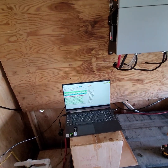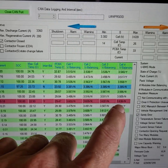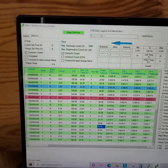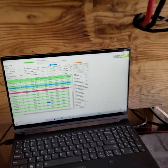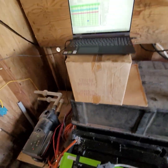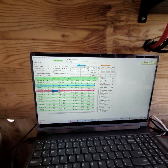It has identified that these are the highest cells in the group — in the whole battery bank — which is acceptable. But these ones are not quite full yet. This battery is only at 3.38 volts per cell, at 97% state of charge. Maybe I had hooked that battery up to something and pulled a little power out of it at some point in the last six months, because I've had these batteries sitting here waiting to get hooked up. So I just got this tiny little charger and it's charging battery number 25, the low one. We're putting a little bit of power in — only one amp. All the other ones are at 0.1, this one's at 1.1, so it's charging. We'll see how long it takes to catch up.